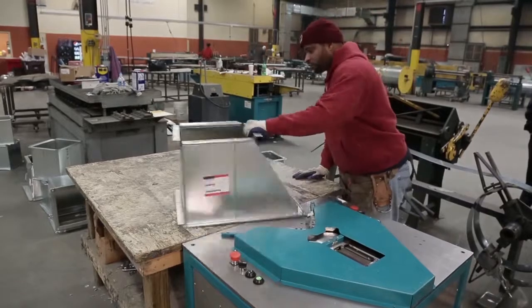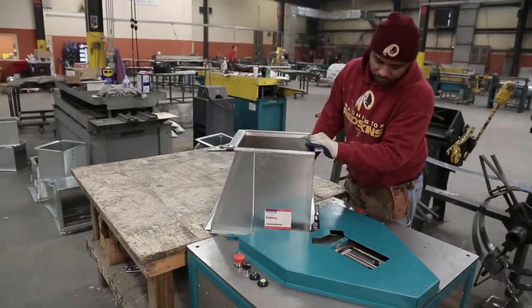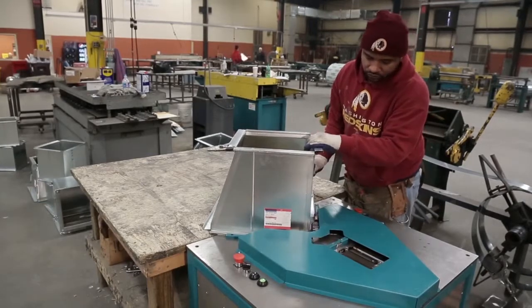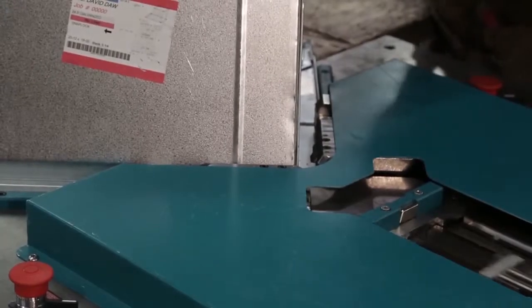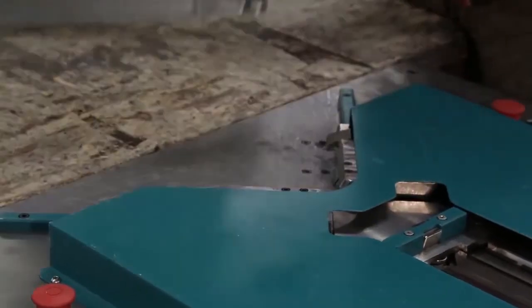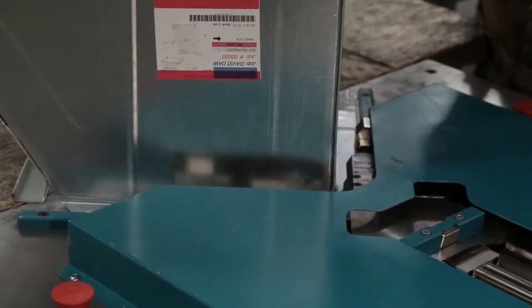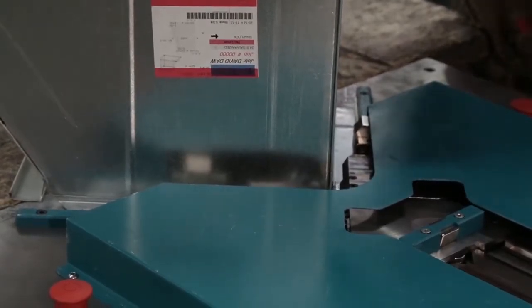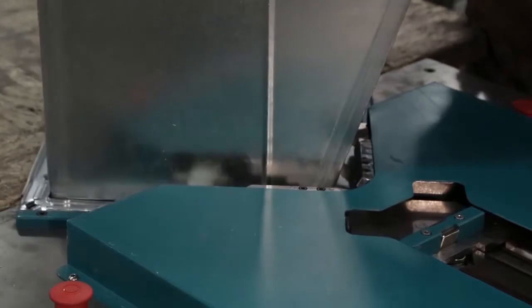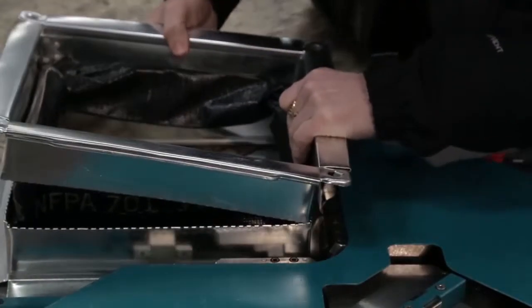I think it's good. It's efficient. It works quicker. When you got fittings, it's a fast process. We're trying to put every last different type of fitting in there to make sure it's not going to jam up on us. That's the biggest part about it, is to try to use it on everything that we got. Our shop ranges from 26 gauge to 16 gauge, and the fittings go from elbows, transitions, straight pieces of duct, anything, hard setting transitions. And canvases too, it works for that also.